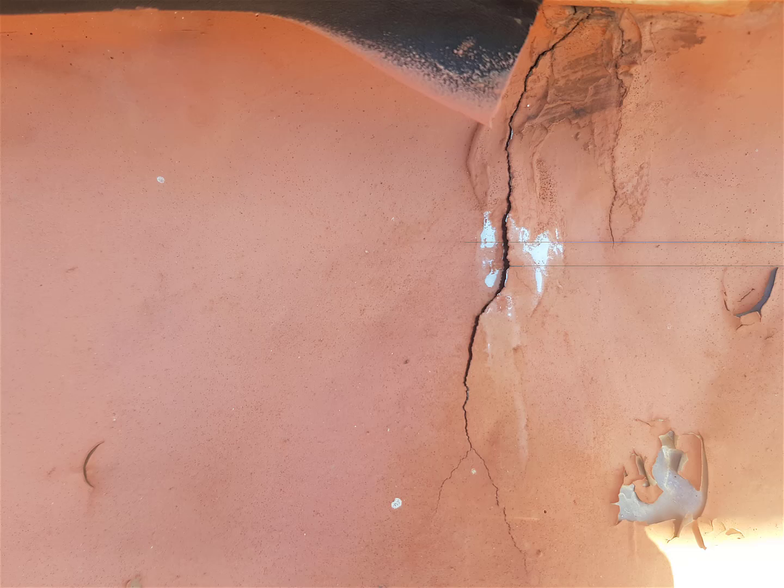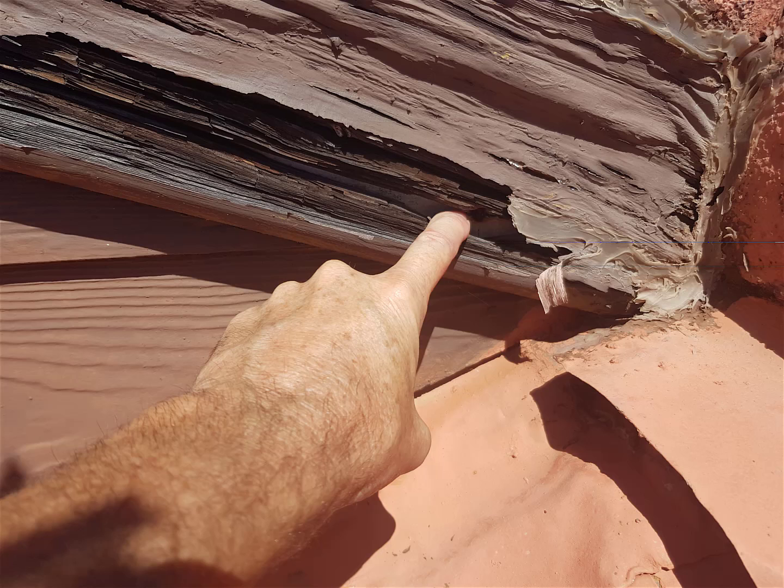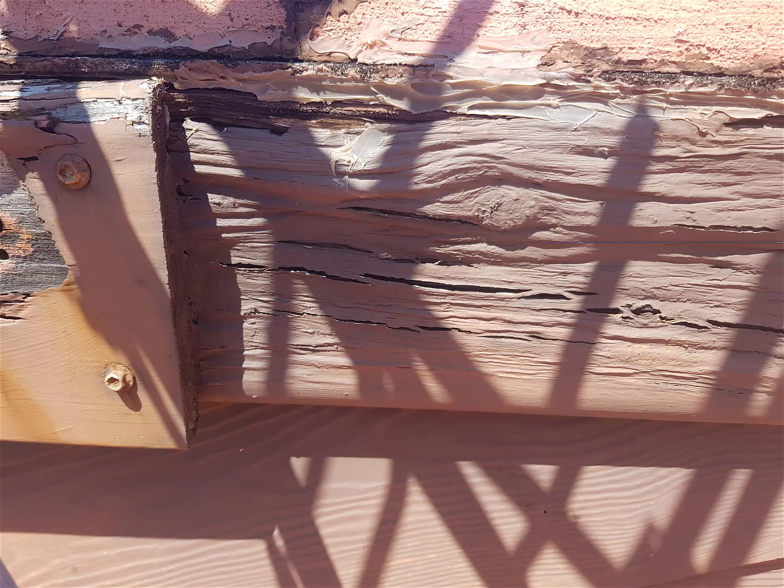These pictures here are cracks in the leadwork, and they'll definitely be leaking into the home, and they need to be sorted out, and we'll talk about that a little bit later as well. Up the top, on the top of the dormer now, if you're at the back of the house, this is on the right hand side, and this whole fascia board or barge board here is completely rotten, absolutely gone, not salvageable in any way, shape or form, as you can see. And if you take note of that funny bit of wood, it looks all sort of wrinkly, and that's because it's shrunk, and it literally is like an old person that's shrunk and wrinkly because it has dry rot.